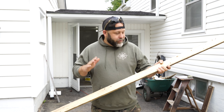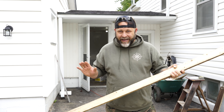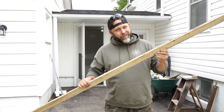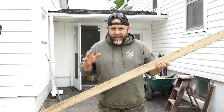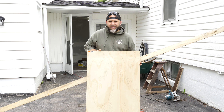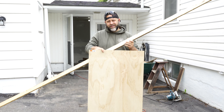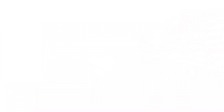As per the vision, we're going to use these straps as the vertical shiplap throughout the design. For the doors, these are too thick, so instead we're going to mimic it with quarter-inch ply and rip these to the same dimensions and width as the strappings. Perfect — let's do it.